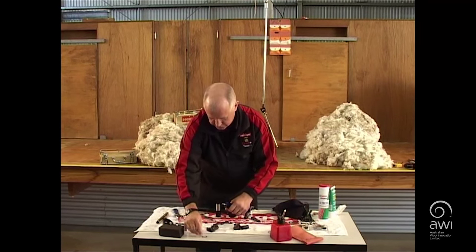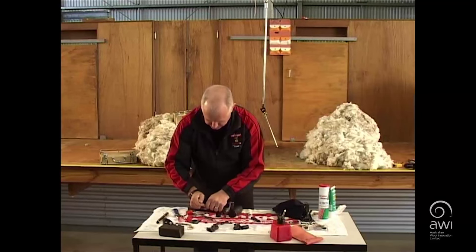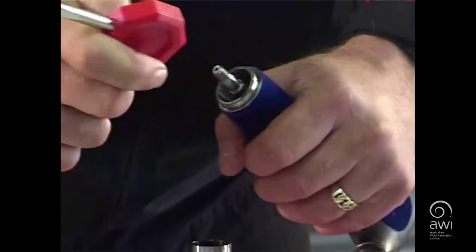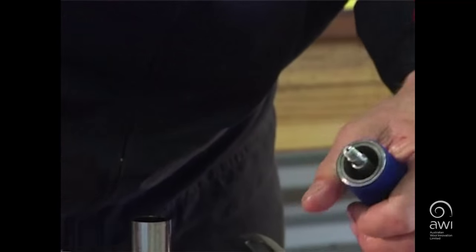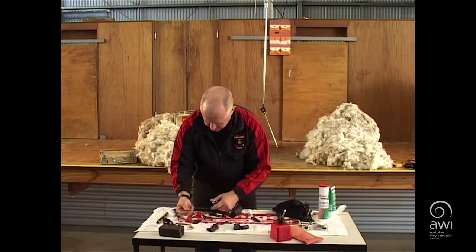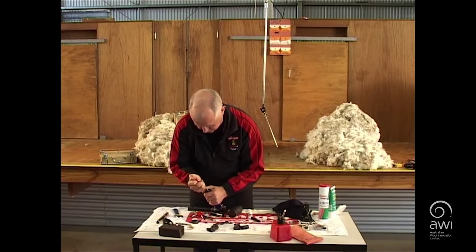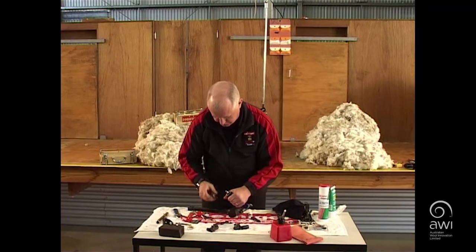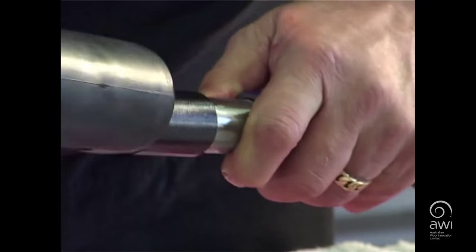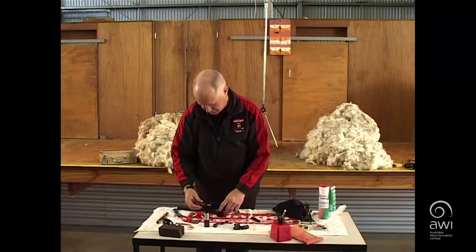Place the wave washer — that's the wobbly one — into the barrel and then the bush. If the bush is tight, knock it lightly with a screwdriver until it slides down the barrel. Then put the circlip inside the barrel. The circlip must be expanded in the groove perfectly — it will, if you have cleaned the groove properly. Place the tool at the end of the barrel and knock it lightly until the circlip pops into its seat. Check the inner back joint half turns freely with the circlip.